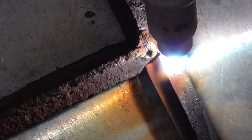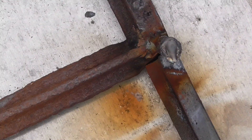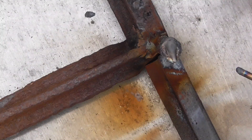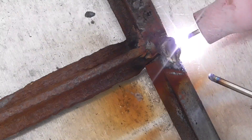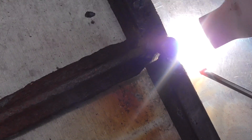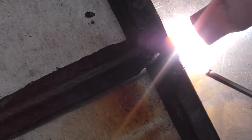I made a few mistakes along the way, and a lot of these turned out to be my foot pedal controller — I've got a video, or I will be doing a video, on repairing that. The pedal was sometimes not returning properly or not increasing properly, so sometimes I was asking for amps and not getting them, and sometimes I was getting amps when I didn't want them.